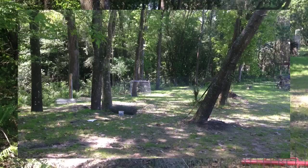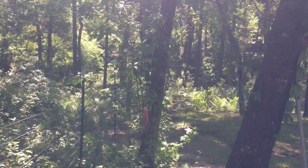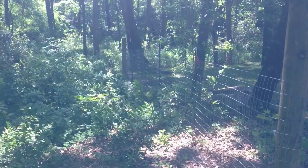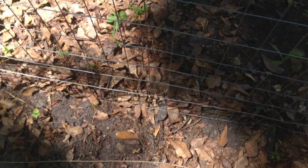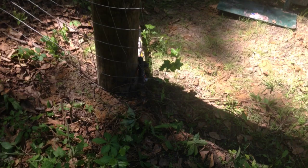I've done that section over there; that part hasn't been done yet. I've started to pull from this big end post to the other big end post in the corner. My problem was the uneven ground right here tended to bunch. I could shovel it out or make a little ditch to fit the fence down into, but it's not practical enough. Eventually the fence will fall into place. That's how I solved it — put a pry bar in there with a lever action, pulled it tight on the bottom. Once I secure it down here I'll pull it even tighter and get all the little bumps out.